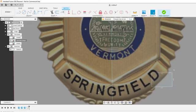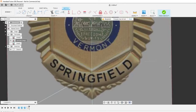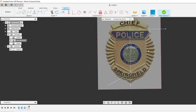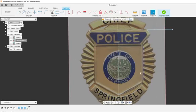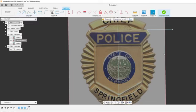I can hotkey my rectangles. If I want to trim something, hit T, and I can trim it. Hit E, and I can extend it. Q does my arcs, and I can just make an arc wherever I want to. O is an offset, so I can just offset something. If you see me go through something and wonder how I did that, just give me a holler and I'll show you where it's at up here, because most of the tools are up here.